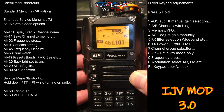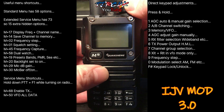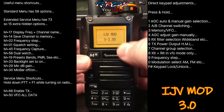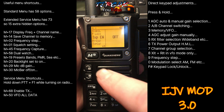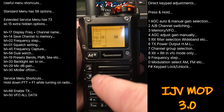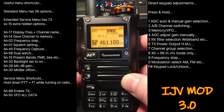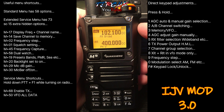If you're not able to transmit, it could be because you haven't got it switched on within the service menu. As you can see, TX is disabled. You'll need to go into the service menu — turn the radio off, hold PTT and Function 1, switch on, service enabled — and it's Menu 68. You can see it's off here; press Menu again, and the arrow will change it to on. Press Menu, exit.